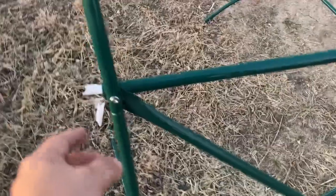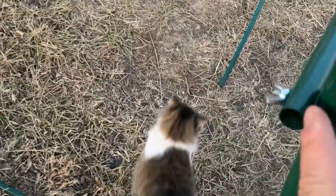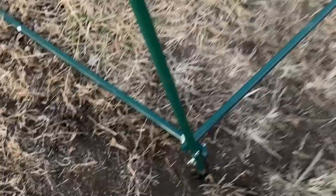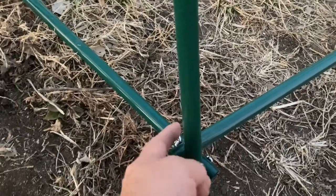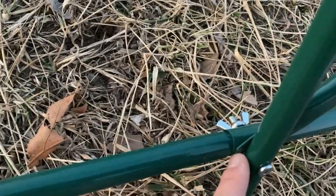A few gotchas to watch out for: the eight and three are on the outside; five and three, five and three; once again eight and three. When you put this junction together, make sure this bar here is on the outside and the bar in the middle is in between there. Same thing down here — bars are on the inside, the ones running across are on the outside. And then you got a two right here — one, two two. Same thing at that junction: make sure this bar is wedged in between there. That's what it should look like.